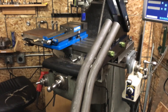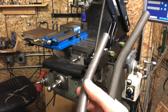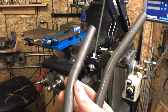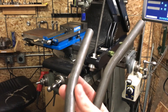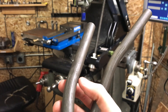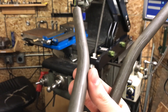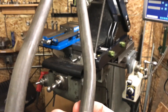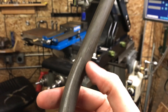So here they are after the bend. Like any bender of this style that doesn't have internal support, probably the biggest single artifact you're going to see is right here at the end of the bend — there's sort of a rolling pin action. There's material on the inside that needs to go somewhere; it's getting stretched on the outside and compressed on the inside. It doesn't ripple or kink, but just at the end of the bend there's just a little bit of a hump. It's pretty subtle, pretty hard to see. The beginning side of the bend, there's no hump. It's just a very subtle little hump.